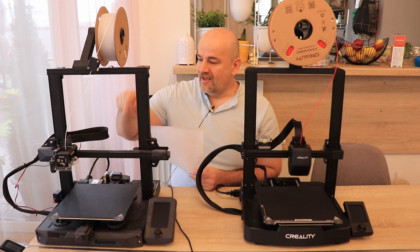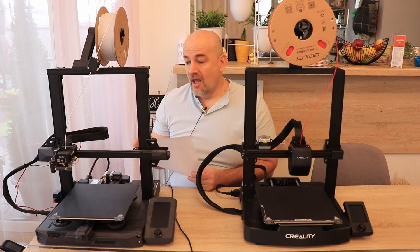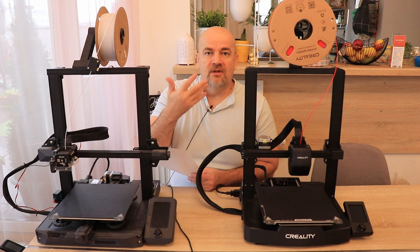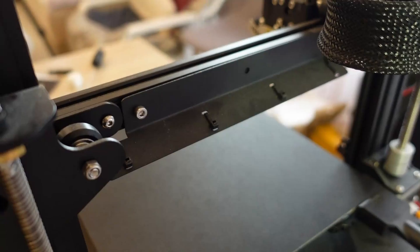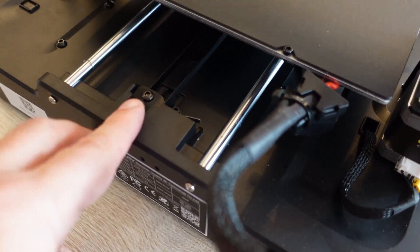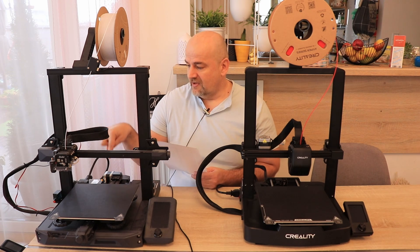The X belt position on S1 is on the top and bottom of the aluminum extrusion, while on V3 it is on the front and back side. With the V3 solution we cannot attach things to the back side of the extrusion because the timing belt is there — for example, an auxiliary fan for additional parts cooling or LED lights, which I find very useful. The Y stepper motor is on the outside on S1 and inside the base on V3. Since this is the hottest stepper motor, better cooling is achieved when it is outside.